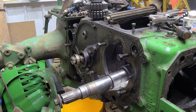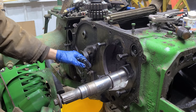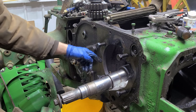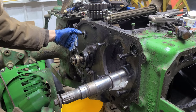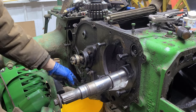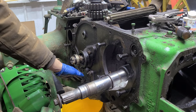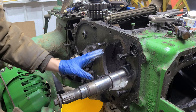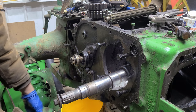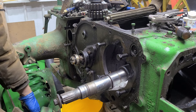The purpose of this gasket is that on the letter series, this is engine oil that runs to the first reduction gear cover and drains back to the crankcase. That helps maintain separation between engine oil and transmission fluid. On the numbered series, everything switched to transmission fluid, so you want seals to prevent oil from your main bearings from entering the transmission fluid via your first reduction gear.